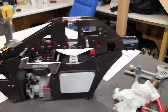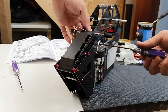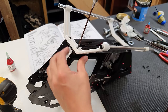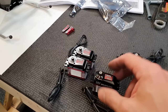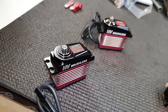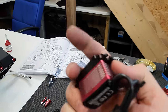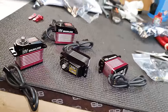The engine's in and I've just temporarily put the tail gearbox on there so all the holes line up perfectly. Now I want to go over it all, do up all the screws, and hopefully the frame and everything's going to be nice and square. Next we've got to install the head servos - check out these servos, they're fully metal-cased, metal-geared, and they really do look like premium quality servos. They're high-voltage brushless. Here we've got the tail servo - these ones are usually a lot faster but with slightly less torque.